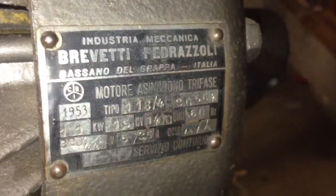I'll just show you on the side here. We have 1.1kW, which is roughly 1.5 horsepower. I believe the 1.5 CV is a service factor. It's 1,100 RPM, 60 cycle, 3-phase or tri-phase motor. Made in 1953.